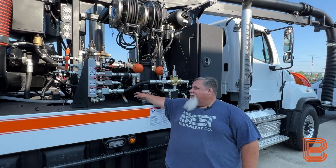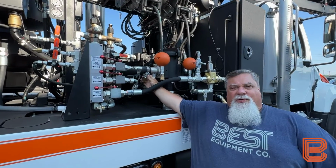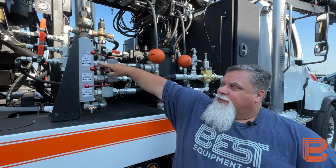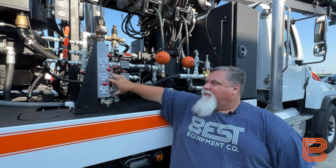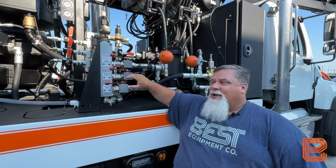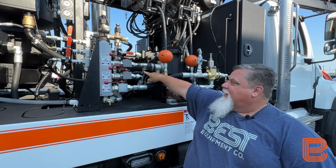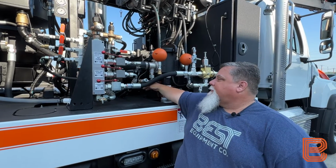In order to winterize the unit, we're going to use air to push through the circuits in lieu of water. We do have a connection here with our air purge port if you have a water manifold in this section. If we do not have a water manifold here, there will be an air purge valve similar to this fitting on the rear side of the water pump assembly.